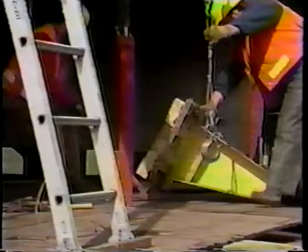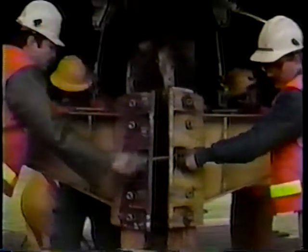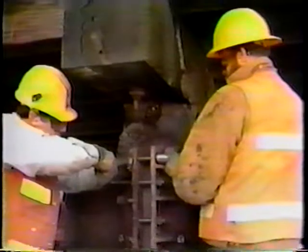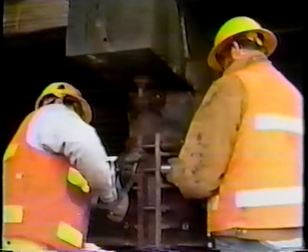After shimming the piles, the next phase in the cap change is putting the pile clamps in place. The matching circular clamps are moved into place across the level platform and then are winched into position. Each clamp has 5 holes, which bolts are put through to sleeve the clamp around the piling. Once in place, the bolts are torqued down to approximately 300 foot-pounds. This process is then repeated until each piling is sleeved with a circular clamp.